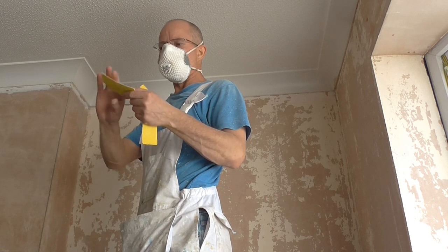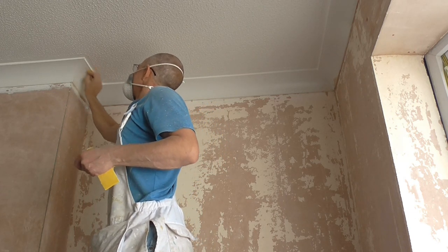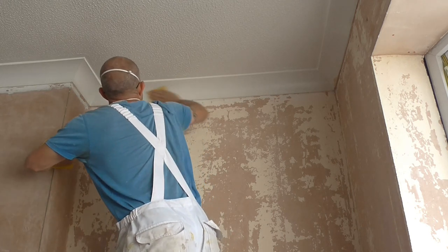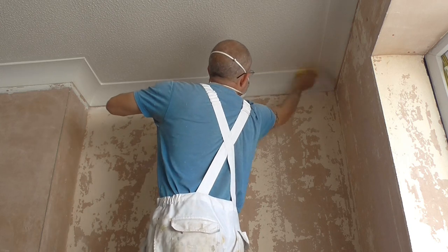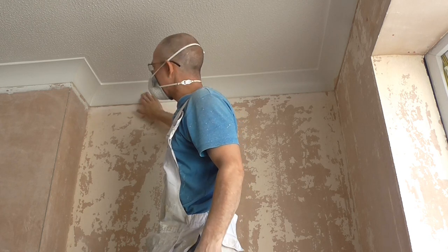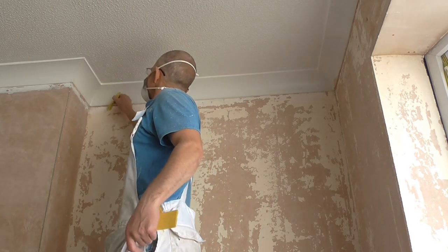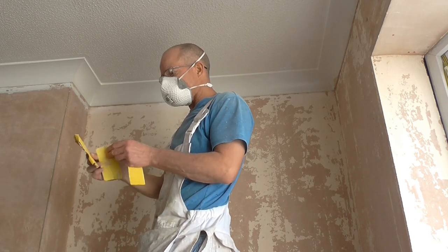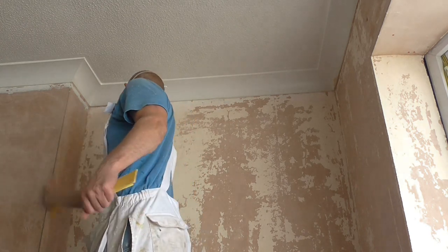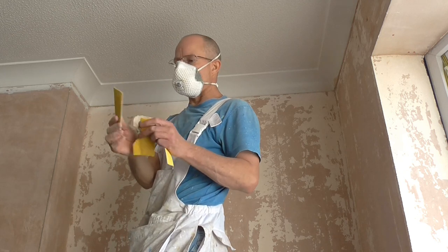I've got two types of sandpaper - one's slightly smoother, that's for the coving. So just go round the coving and give it a quick sand. What you're doing there is one, you're keying it because it's a flat surface, and two, you're de-nigging it - getting rid of all the old little bits of paint or where anybody's gone on to it with a roller. You can sand it all back and it just makes your job a lot neater. Then go in with some rougher sandpaper underneath the edge of the coving and wall.